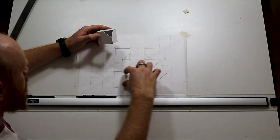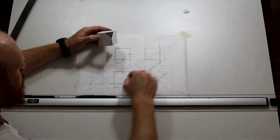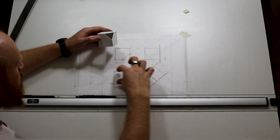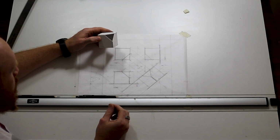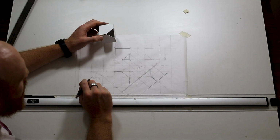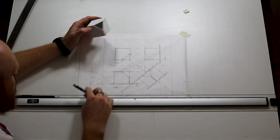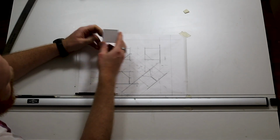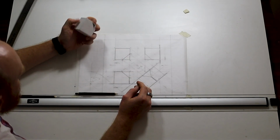And remember that you can hinge with the arc, you can hinge with the angle bisector by going across it, you can hinge backwards and forwards as long as you maintain your directions and parallel and perpendicular movements. So everything's got to be parallel and perpendicular, everything lines up. Once you have a few base measurements, you can start drawing everything, and I can keep going from this now. For the most part, I can draw any view of this cube I want. Right? Some are a little less exciting, though there's some detail in there, and some show us quite a lot of interesting things.